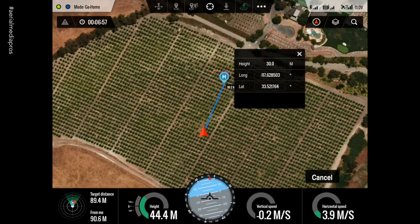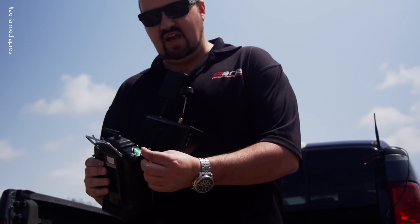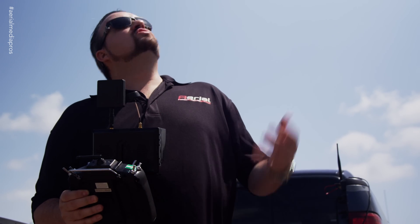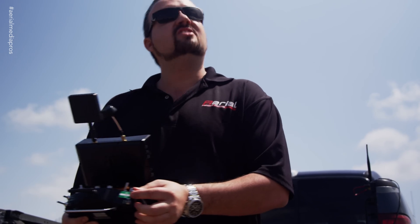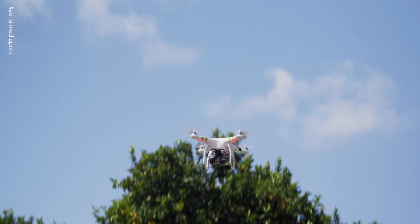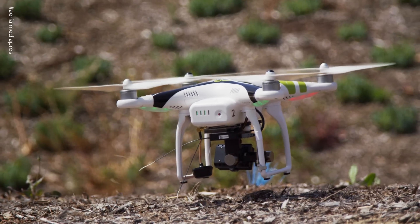The second way is we can pause it wherever it's at, then click the come home button. I'm going to click edit go home spot, put the altitude that we want it to come home to — I'm going to bring this to 30. Done. Home point set. Hit go, and now it's going to come back home. So once it gets over us, I'm going to go ahead and show you the final way to regain control, and that is to take it from GPS into attitude mode. Go all the way down into attitude mode and that's going to regain control. Make sure your throttle stick is at least half because we don't want to go to attitude mode and just drop. Attitude mode — I have control of it. Now I can fly it around, do what I want with it, and land. I'll bring it in for landing.